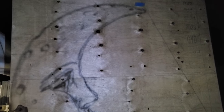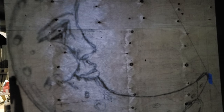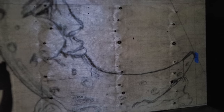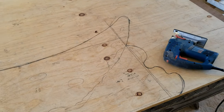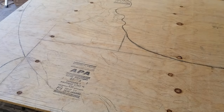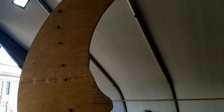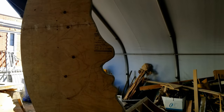We drew it on two sheets of three-quarter inch plywood. This thing was big — I think it was eight feet tall. One of the things we thought would be cool is to hide the two sides of the boxes with some cloud coverage. The next step was to take a jigsaw and cut the whole shape out. Then to connect the two pieces of plywood, I just used a wide crown staple gun and shot them together from both sides.